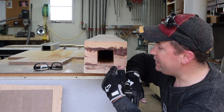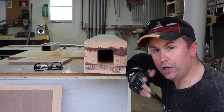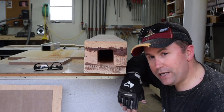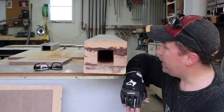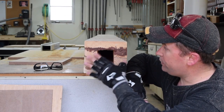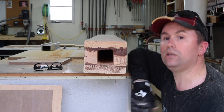What I'm going to do now is take these apart and put a couple coats of epoxy — maybe three — on each half inside the shaft log, just to waterproof it. And then once that dries and cures totally, I will glue this all together with the Resorcinol glue, and that'll be our first piece done.